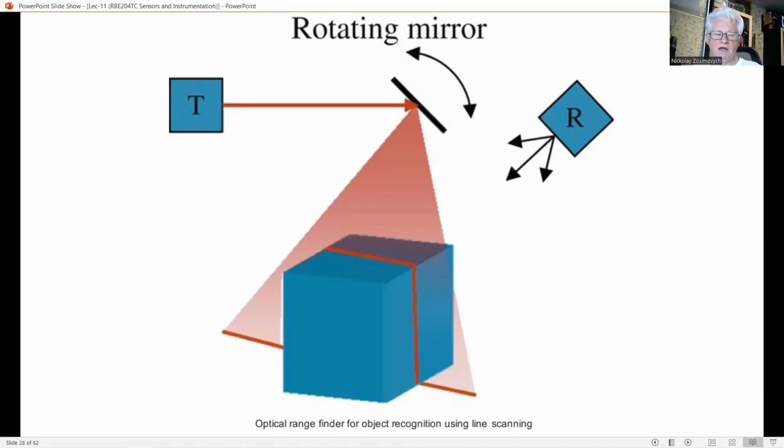In general, not all points of the object are illuminated, and not all illuminated points may be viewed by the camera. Those shadows prohibit capturing the whole cross section. When this is not acceptable for the application, a second triangulation system can be used, operating under a different angle.